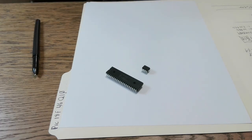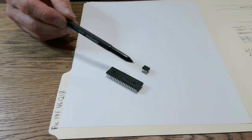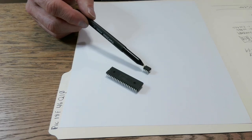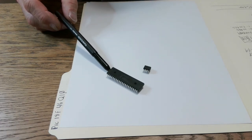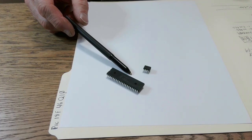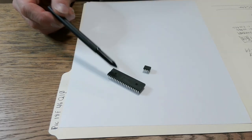I'm going to build a program with you and we'll test it out on a breadboard at 5 volts. First of all, this chip is 10 years newer — from 2020 versus 2010. It has 6 IO ports versus 36 IO ports, and this one runs at only 4 MHz internal oscillator, while this one will run at anything from 64 MHz all the way down to 31 kHz.